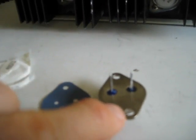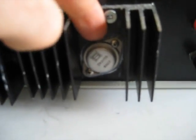You also put a layer on the heat sink between the washer and the heat sink, so that we have a very good thermal connection — not electrical, but thermal — between the transistor and the heat sink. If you look very closely, you'll see there's some paste on the heat sink, then the blue washer, then some paste, and then the transistor itself.